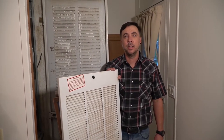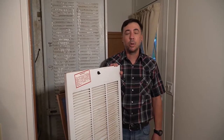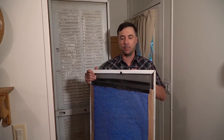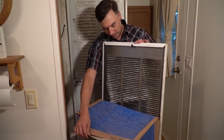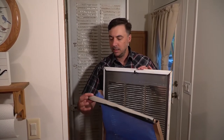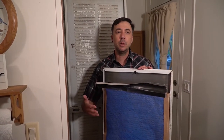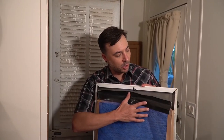One very important piece to know about your furnace is the furnace filter. It protects the furnace from dirt and debris, but can also get plugged up and cause the furnace to run inefficiently. I recommend checking it every month — maybe when your energy bill comes — and changing or cleaning it when it's dirty. The filter is typically inside the back of the door to the furnace. You can buy the same size disposable type, or a cleanable reusable type that you cut to size and wash. Pleated types offer better filtration but get plugged up faster. Make sure the filter is the right size and installed properly so no dirt or debris passes around it while the furnace is running.